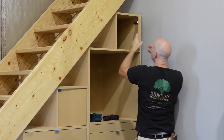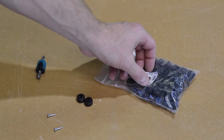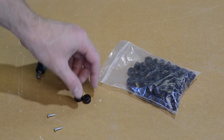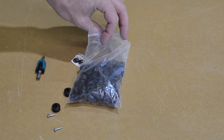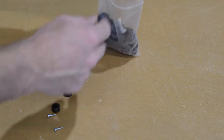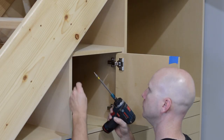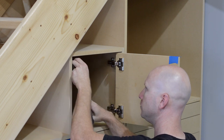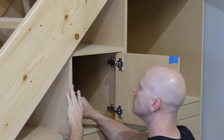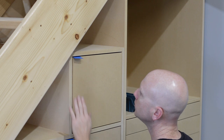You'll notice that this door closes too far, so the next issue to solve is to set up a door stop. I like to use these Euro door stops made by FastCap. The hole is eccentric so there is some adjustability when installing these. Don't worry — most of my ancestors come from Europe, so that makes any door I produce at least 1/16th European and therefore eligible to use these stops. After getting the door stops installed the door closes right to the perfect spot.